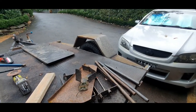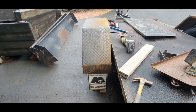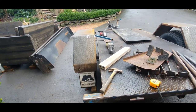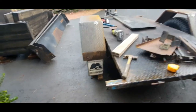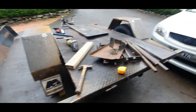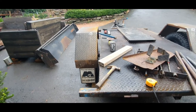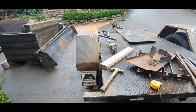I've cut the edges and sides off, just with the grinder, filling up all the bars so that guard is still attached. This guard though has been taken off because I'm going to add 25mm and pump the guards outwards 25mm, because I'm changing the offset for the wheels which is going to push the wheels out 25mm each side. Now that I've seen it, I'm actually probably going to add 30mm to the inside of the guard because it'll still have clearance.